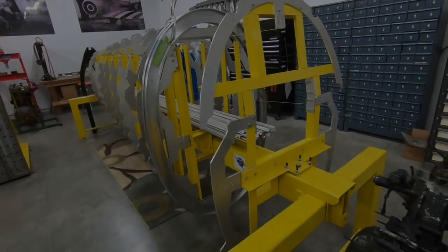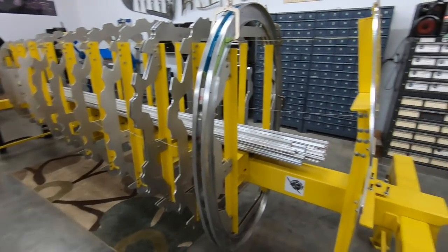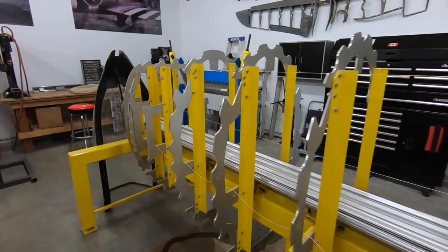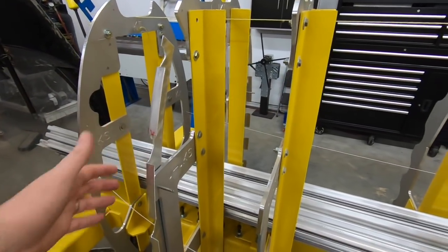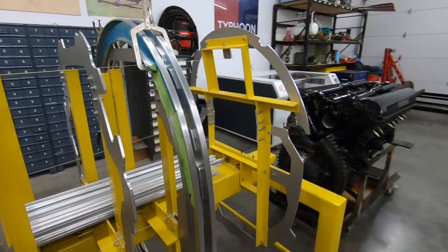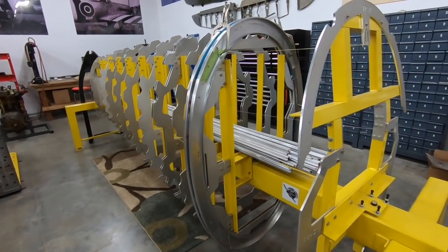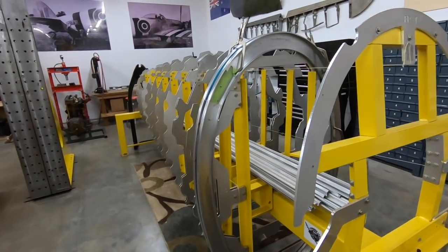So the best place to start is the forward monocoque section, which is this one. And I'm sure you guys have seen it in social media posts, in some of the video episodes, and just in general discussion when I was talking about producing some of the frame segments, like this guy here at frame JK. And we've got frame A set up in here. I had to do some trimming on it, so all of that stuff is done now. But I want to take you through this section of the build because there's some questions about it and a lot of interest in what we've done here.